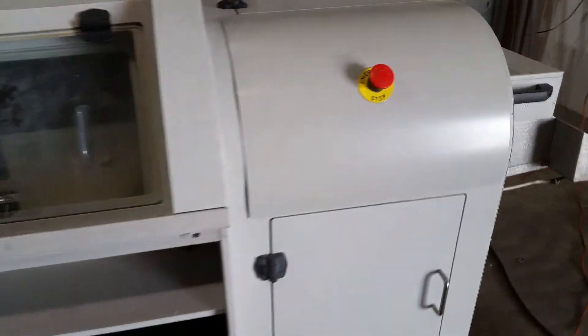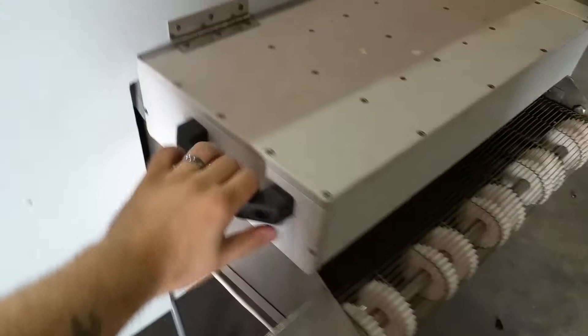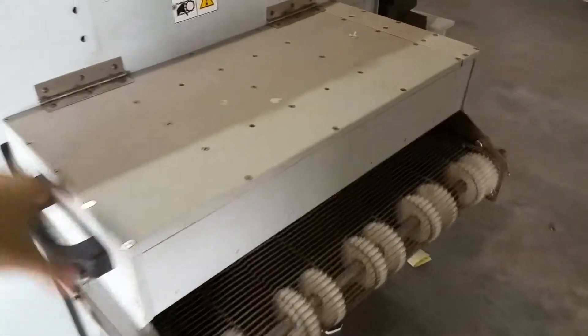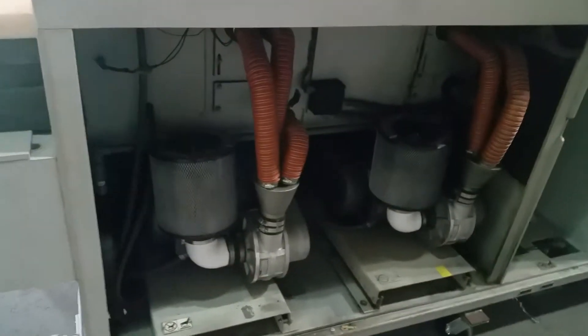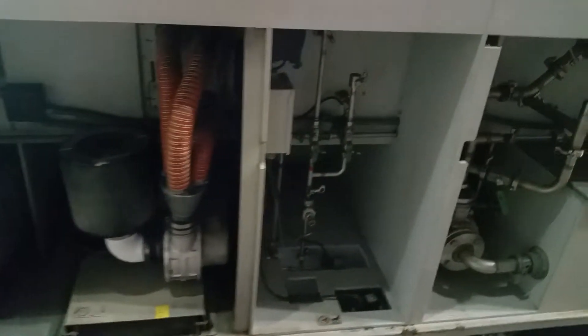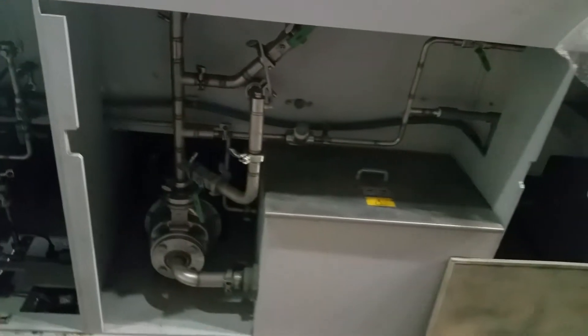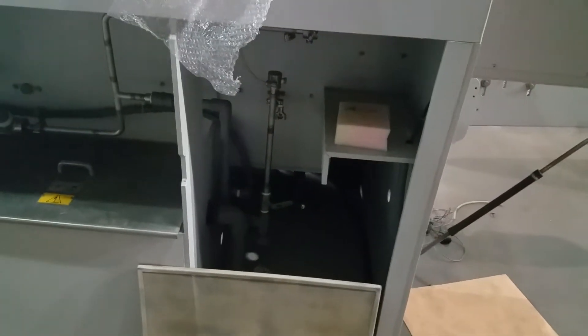Come around to the output — emergency power off. Output portion of the conveyor for the machine. Around to the back, panels have been removed to show blowers for the drying section, plumbing for the rinse section, pump, plumbing and retention vat for the wash section, and plumbing for the pre-wash section.